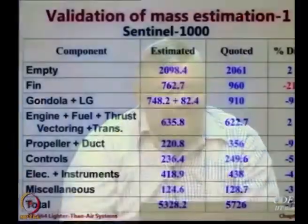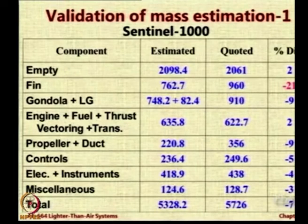People are now referring to our papers on remotely controlled airship sizing because we have our own data. But our work is focused on a particular type of envelope and particular material. So we are within 10 percent error except for the fin — for the fin we are off by 21 percent. The actual fin for the Sentinel-1000 was far heavier than predicted. We had two formulae: Raymer's formula for aircraft fins and the area-density method, but both were giving wrong values. This opens up an area for someone to investigate further — what went wrong in our fin calculation and how to get a better estimate.